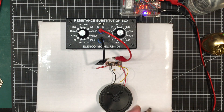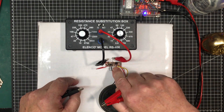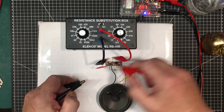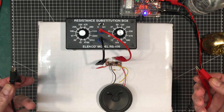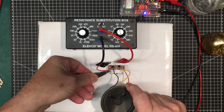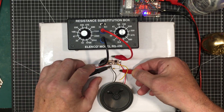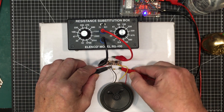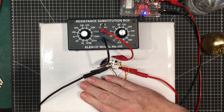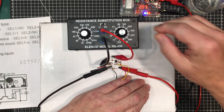Now, if I'm not mistaken, this has no off position. There is one pin I experimented with years ago — I think if you ground it, it shuts the thing up, though I'm not sure if that's intentional or whether you're just shorting something out internally. Let's get some power attached. Turn your volume down. I'll put my hand over it — this here is supposed to be an alarm whistle. Let's see what happens.